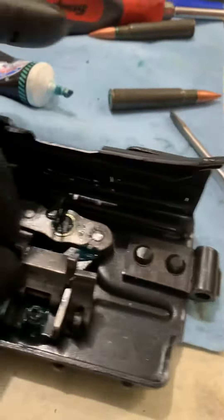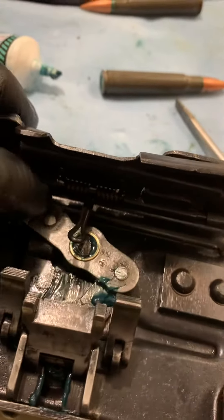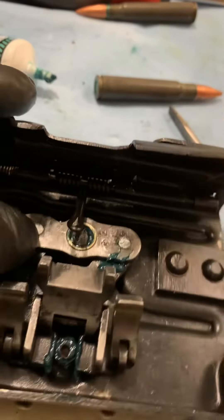All tight. I reused the piece over there — I can get another one, but those guys want a lot of money for that too. And I fixed it. The little bushing there, the brass bushing. I opened the hole in that piece over here. I machined the piece of brass for fitting a shaft like that.